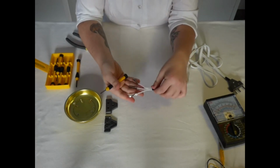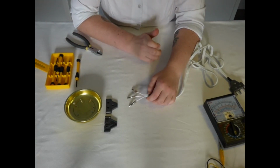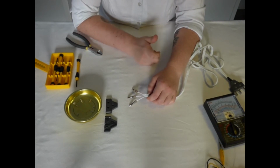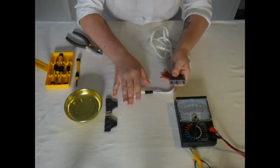There, now all three of my wires are back together with prongs securely attached. As a final check, I always like to make sure that everything is actually still connected to the correct points. I know we did our marking earlier, but I prefer a bit of redundancy in my checks so I don't have to repeat the entire process if I made a mistake. Go ahead and get out your multimeter again and make sure that all your lines match up.